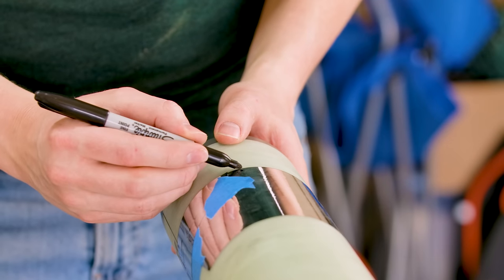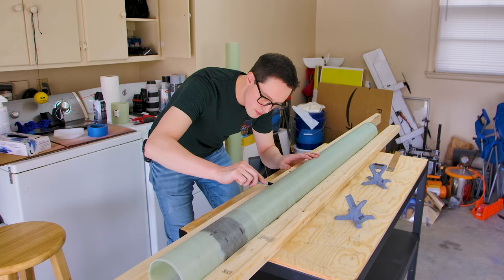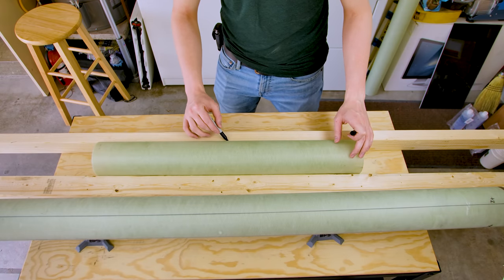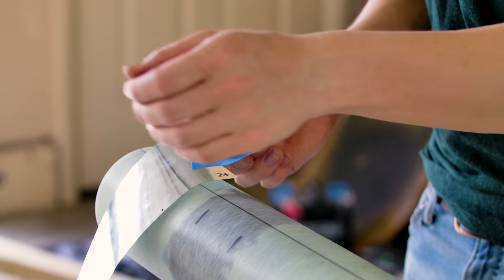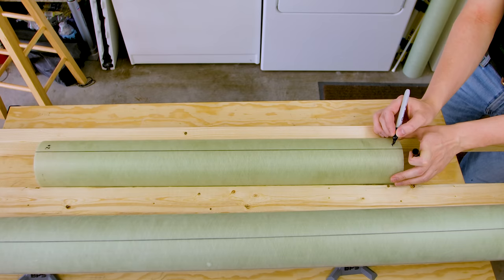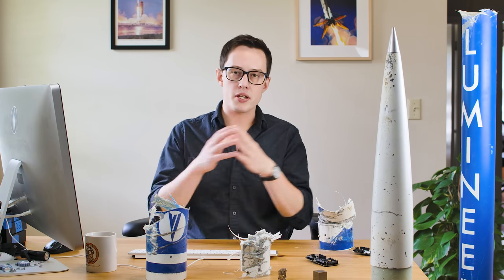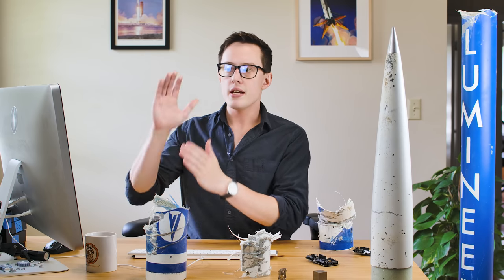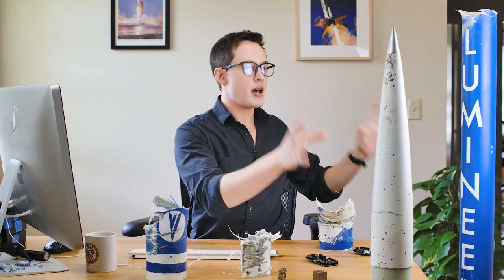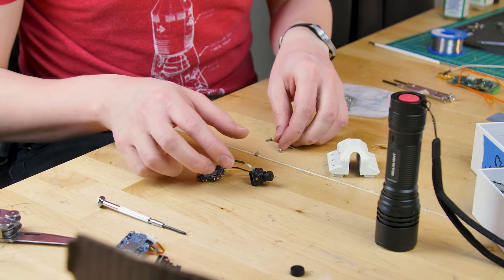It's also worth noting that really early on I defined all of the axes on the vehicle. I always think this is a great idea to do on any build as soon as possible so you have a sense for what orientation is what when you're building. I did this with a sharpie and some straight edges, then used a piece of mylar and marked out paper distances for each of the four axis definitions. The reason we do this is that we want everything in CAD to match up with everything in real life, so when we have axis definitions, that has to match in real life. Label your axes.